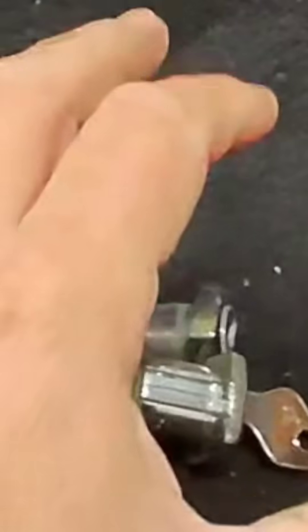If you don't know about that number and what it does, you are vulnerable. Somebody can come along, get a key cut without your knowledge, and steal all your stuff. These are tubular locks — we put these in place of these locks. Much more superior, better quality, different format, no numbers on the front, no master key. Swap them out to a tubular lock and you'll have no troubles.